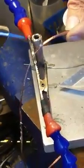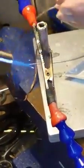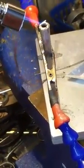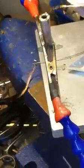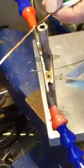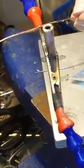You can use what is called a solder wick. If you ever get too much solder and you need to remove it, you can use a solder wick, and what it does is suck up the excess solder. The solder is not quite hot enough. You can see how the solder wick sucks up the excess solder. That's less mess for you to have to deal with afterwards. You can pick up a solder wick on Amazon.